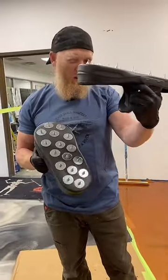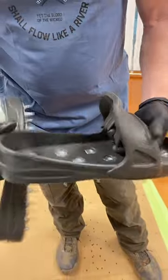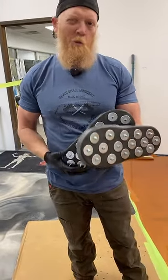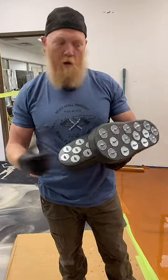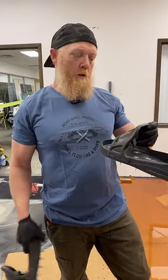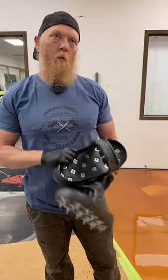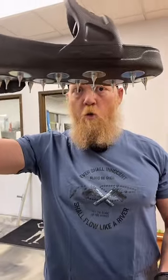Now everybody is enamored with our shoes — these are spiked shoes. It's a very tall, very pointy spike. It has little flaps that catch on to the front of your shoes or boots and hold them on like a pair of Crocs. A lot of people want to use golf shoes, but golf shoes moved away from pointy spikes about 10 to 20 years ago. If you find an old pair with pointy spikes, they're money. Get a size bigger so you can leave them tied and just walk on and off your floor. The brand is Shoe and Pro Finish — we sell some, but this is not an ad. Round or long cleats like baseball will get slick on epoxy, so you do need a tall sharp spike. I keep thick cardboard down at the edge so I can walk directly on it — it actually cleans epoxy off the spikes.